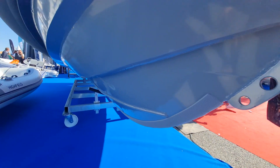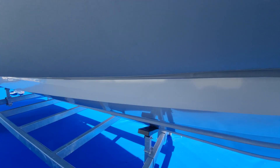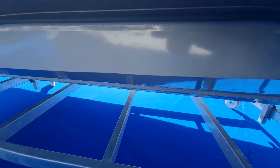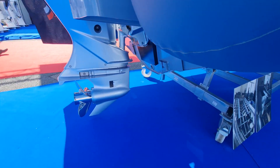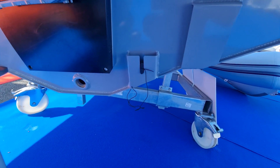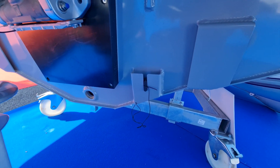The ability of this hull is really quite amazing. Coming back towards the stern, you can see that the angle of attack in the bow becomes slightly shallower the further aft you come — that's also an important point when talking about deadrise. You will see the angle at the stern is much shallower than the angle in the bow, but it's still 26 degrees, which is very deep in the RIB world.